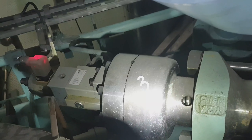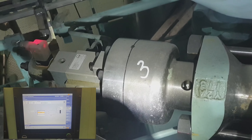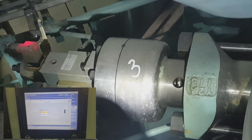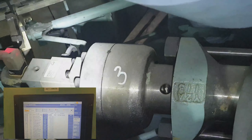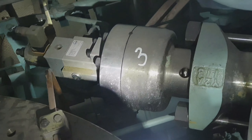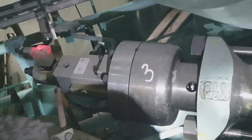Once it is switched off, the signal is off and the spring returns to closed position. This is how it is being tested. This time, number three — as we have found out, number three has no movement even if it is switched on and off. The spring is not in motion, no movement at all, but the signal has been received. So number three is not working. This is how to test the air pilot valve of each air starting valve.